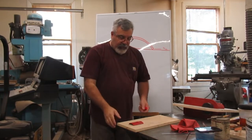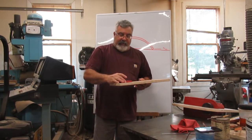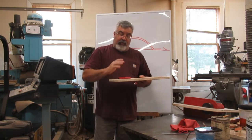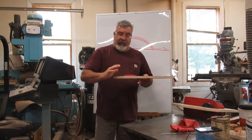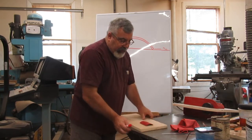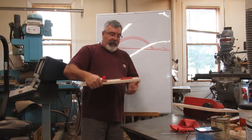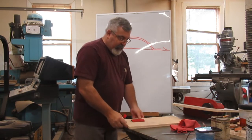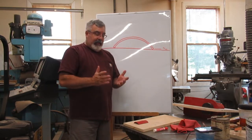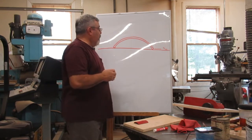Okay, so what I'll do is, like I said, I'm going to cut this a little bit shorter. I'm going to fasten this down somehow, and I'm going to get some 3/32 strips, start working there. Okay, then after that, we're going to have to get this radius over here, okay? And that'll give me my parting block, all right? And then from there, I'll pour a plastic, and I'll have 2 molds, and we'll be able to put them on the match plate, okay?